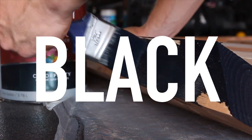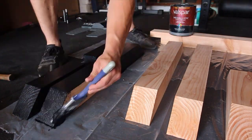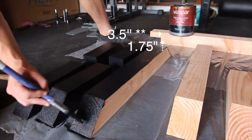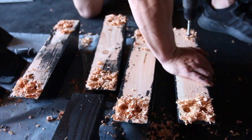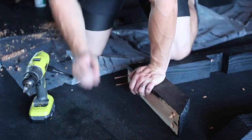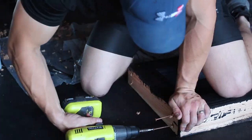Joining them is a 44.5-inch board with the ends notched 1.75 inches in and 1.75 inches up. I'm using a 3/4-inch Forstner bit to recess the 4-inch deck screws used to attach everything. I put two screws in from the sides and one from the bottom, then wood-glued and attached a 3/4-inch dowel and sanded.